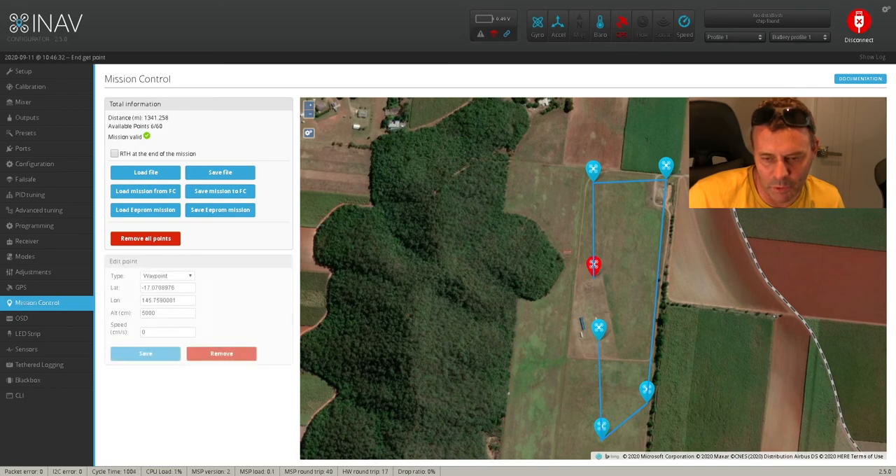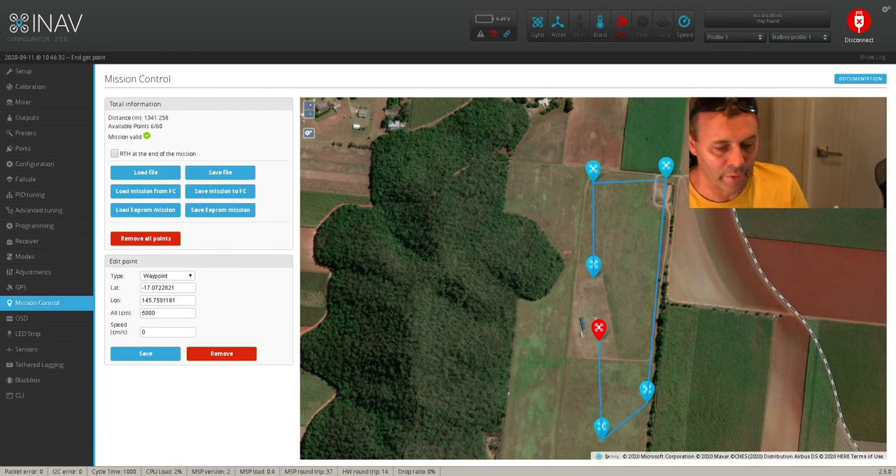So we start off here, double check it — we've got 50 metres at that waypoint, 50 metres at that waypoint, 50 at that, 50 at that, 50 at that, and then it comes back home here with 50, and we'll circle until I'm ready to land it manually. So that's basically it. We'll take it out to the field next and see how it performs, and if it's successful we'll go from there on bigger missions. That's the plan. Hope you enjoyed, hope that was informative. We'll see you on the next video — until then, bye for now.